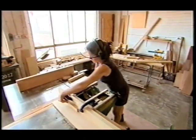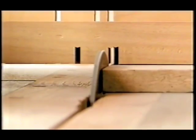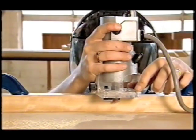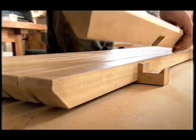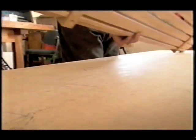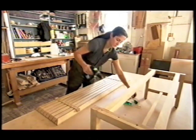While the glue is drying, Laura prepares the slats for the top of the bench. They'll be connected to the main frame using a cross halving joint. For this you remove half the thickness from the top piece of wood, and the same from the bottom piece. Laura uses a router to clean up the joint. When the two pieces come together, one fits snugly into the other. The most important part of the top is the cross halving joints on the support rails — that defines the location of each slat and its distance from each other. I put them together, make sure it's a nice tight fit, and I'll pre-drill and screw from underneath, just as an extra precaution.